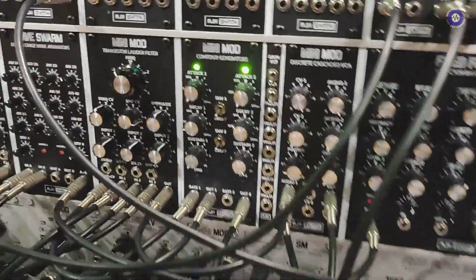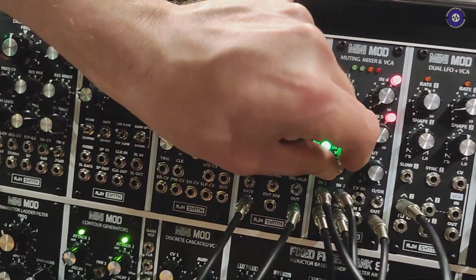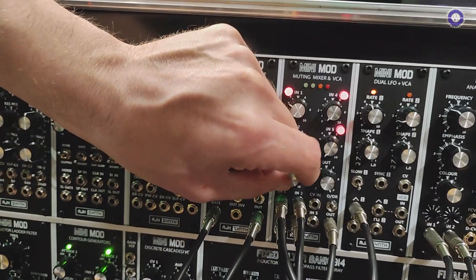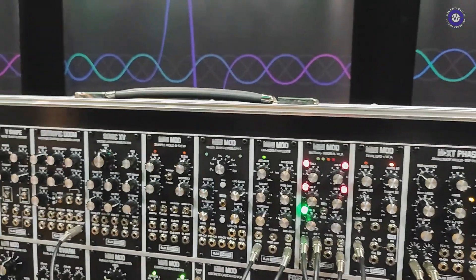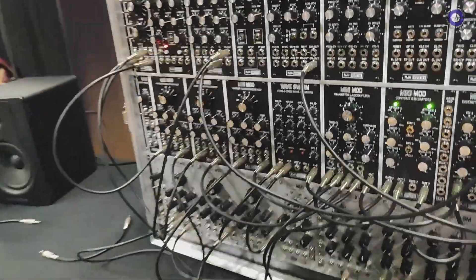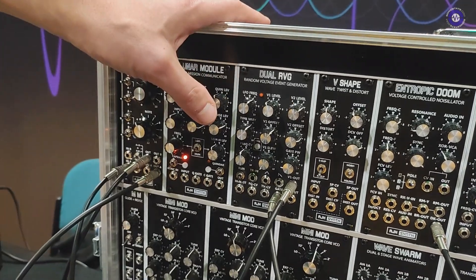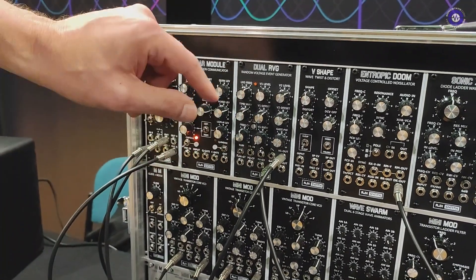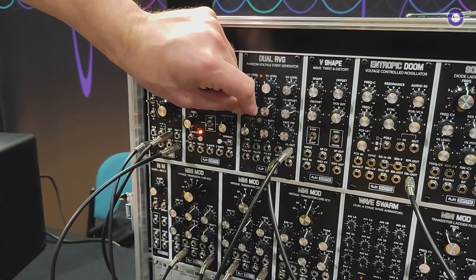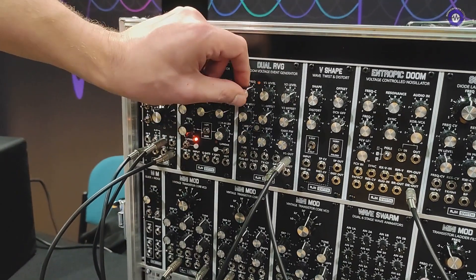I've also got a ring modulator down here. I've got two VCOs going into the ring mod, and the ring mod is based on the old EMS circuit from the Synthi and so on. I've got the dual RVG modulating the pitch of one of the VCOs and it's also triggering an envelope generator. This was an old EMS unit as well, which is now rare as hen's teeth and very expensive to buy. It provides two random voltages — it's only using one at the moment, just to one VCO. Interestingly it's also got this time vary control — re-trig effectively — so you can keep the clock speed really regular.